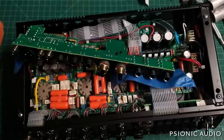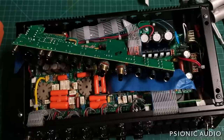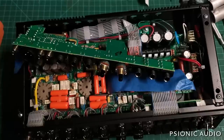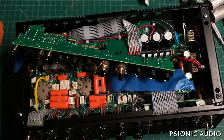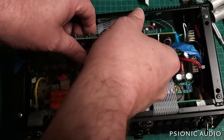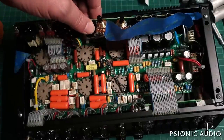And I had to figure out how their mute circuit works. Some mute circuits are normally off and give a pulse to certain transistors, which turn the transistors on and ground things out just for a few milliseconds while a channel is being changed or whatever. This one does it the opposite way. This one is always sending a voltage to let those transistors pass signal, and then it briefly turns off the voltage, which will then mute things temporarily while channels are being changed.